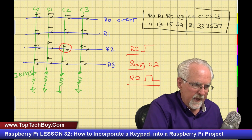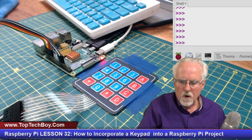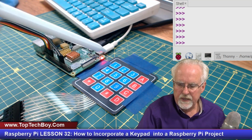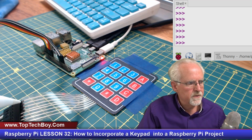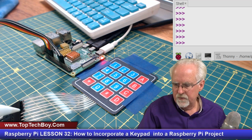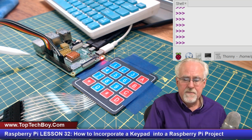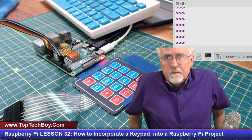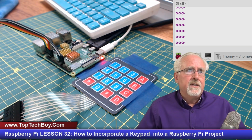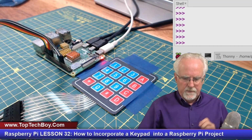When we do that, we just come down here, because remember, this is row 0, row 1, row 2, row 3, and then column 0, column 1, column 2, column 3. That top row of pins, we just come down and hook them up in the same order. I like to use this ribbon cable so that it makes it a little easier to get things set up. Okay, that's enough of telling you how I'm going to do it.